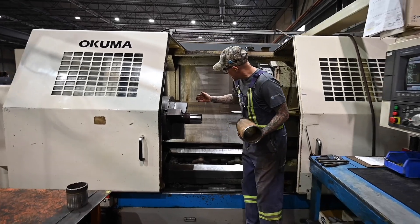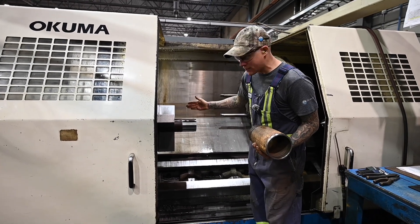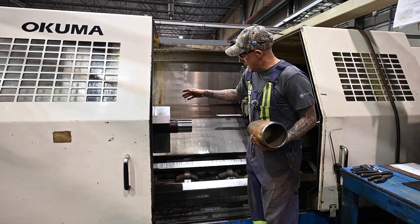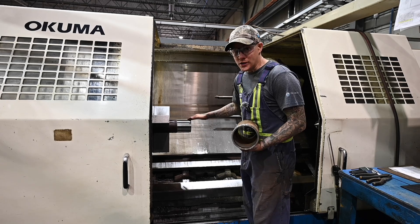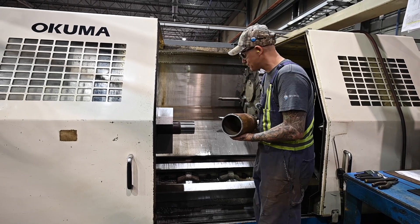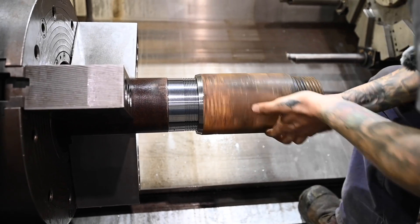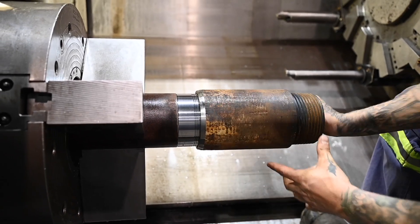I just finished all four ops: rough facing, rough turning, finish turning, and threading for this. Instead of putting a proper gauge on here, I'm going to use the tool joint to make sure it seats in correctly. It's quite long — about three inches here — and this overall length is four and three-eighths.